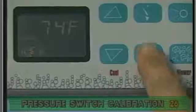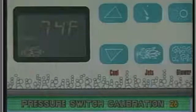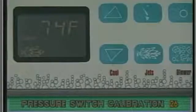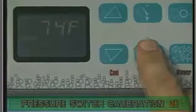Adjust the pressure switch by rotating the star wheel counter-clockwise until continuity appears on the meter. Switch from low speed to high speed if available and run for 10 seconds. After the 10 seconds are over, turn off all the pumps.